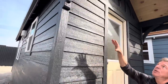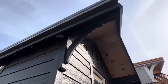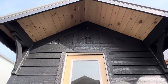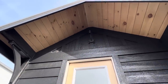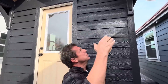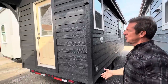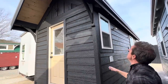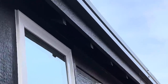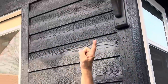This is a special type of caulk that gives and takes, so it's not one that cracks — you're not going to have to redo it every other year, it's going to last. The RJO had a straight gable, but as you can see we put a 30-inch sweeping overhang on all our new models. I did that because I wanted to emulate the old craftsman style. I was out in California and I saw these. You can see the rafter tails sticking out, the fascia board, the gutter, and this corbel bracket with the polyurethane overhangs.